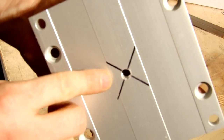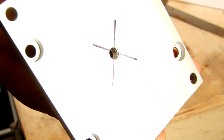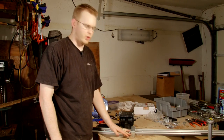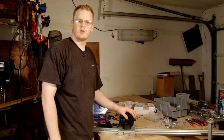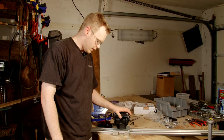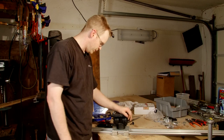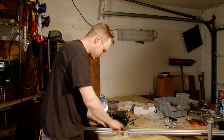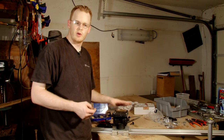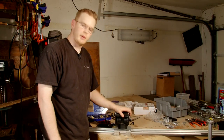And you can see that in this plate now we have threads — and that's what we were looking for. So as you can see now, we've got our tripod head mounted directly onto our plate. Some people use risers to go ahead and give about a four inch lift on their tripod head. This is what I have right now, so this is what I'm rolling with, but I might go ahead and do that in the future. Right now our bearings are loose with our four bolts, but we're going to go around from side to side and tighten them down little by little, so that they auto align and have the best, smoothest slide possible.